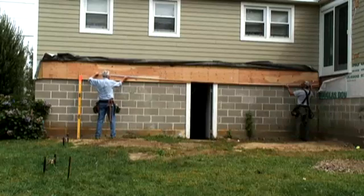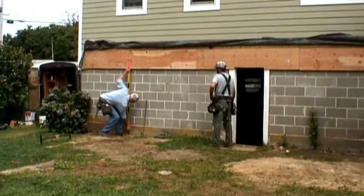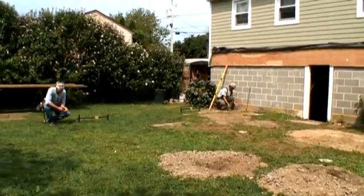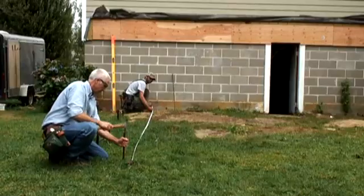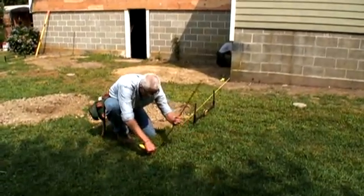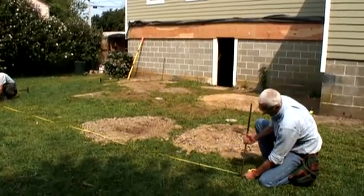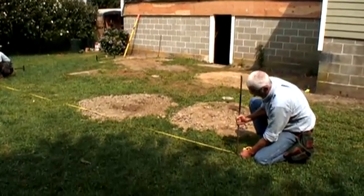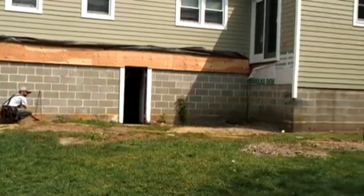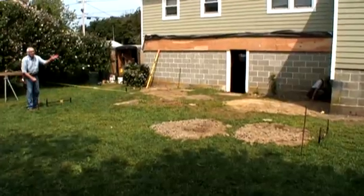From the inside corner, I measure and mark the 20-foot length of the deck on the side of the house. From there, I plumb down to mark the location on the foundation at the ground. We measure out from the wall 20 feet and then drive a stake. We measure out 20 feet to represent the other side of the deck and drive another stake. Next, I adjust those 2 outer stakes until they are exactly 20 feet apart. To make sure the deck perimeter layout is square, I measure diagonally in both directions. If one diagonal measurement is longer than the other, I adjust the corner locations until the diagonals are equal, and then the perimeter is square.